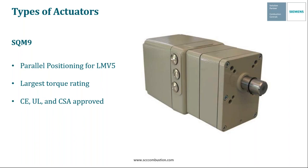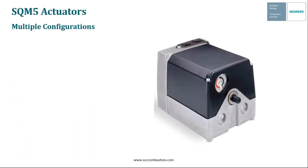Now that we have a basic understanding of the different types of actuators we offer for each specific application, we're going to dive a little more in depth into several of these actuators. Let's start with the analog or modulating actuators and the SQM5. The SQM5 actuator has many different configurations and multiple setups. No matter what type of input signal you're using, the following adjustment options are available on every single SQM5. This includes different torque ratings — we can configure for multiple torque ranges between 90 and 400 inch pounds.